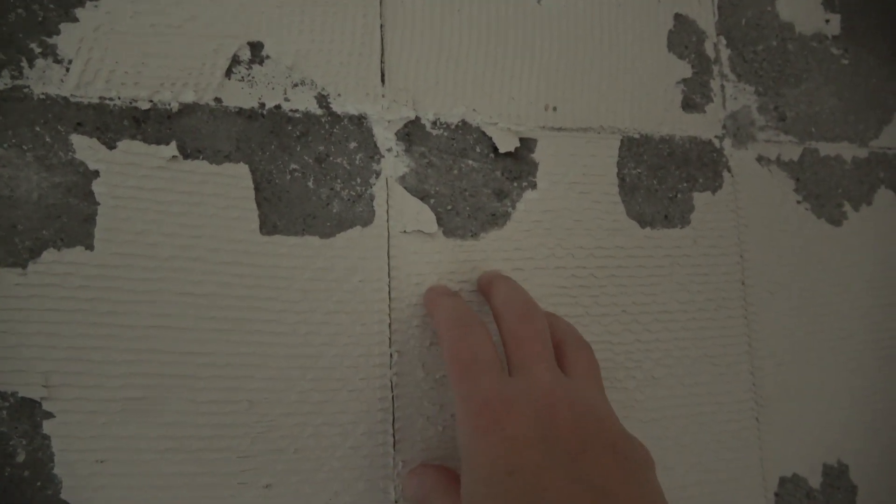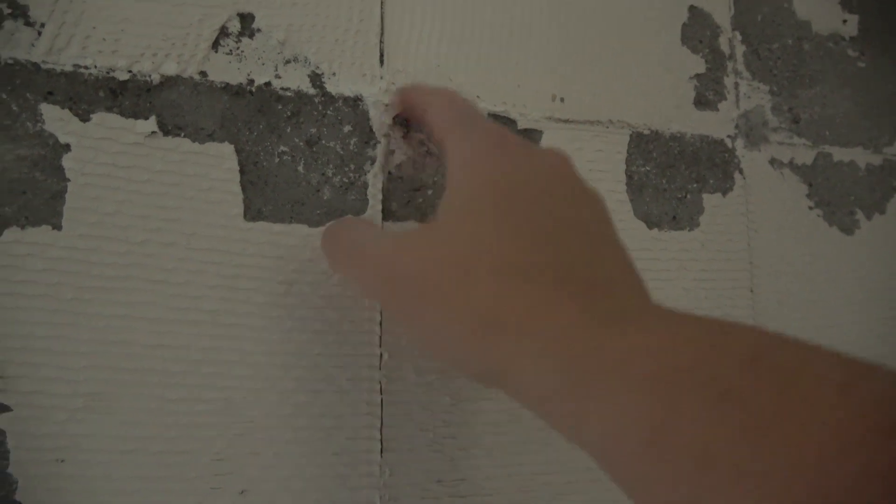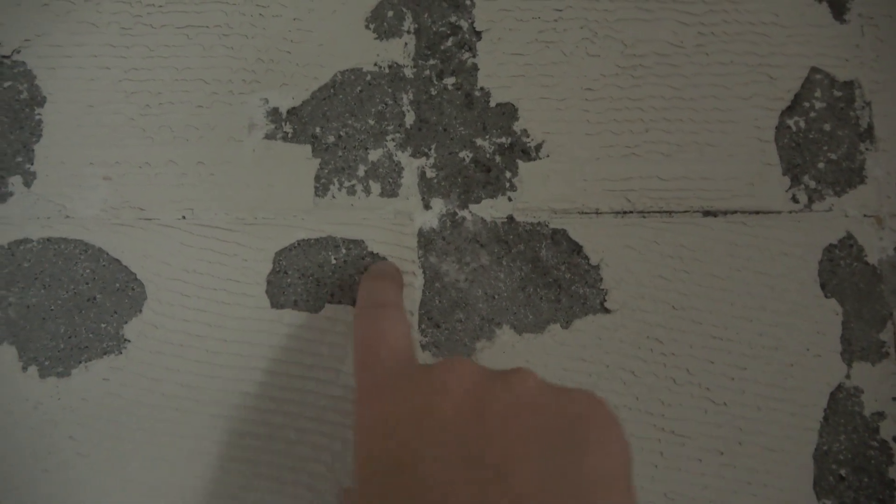It's another weekend. I didn't have much time during the week to do something, and that was probably a good thing because what I've figured out now is that the tiling glue is kind of drying and it's coming off. So as it's Friday again, I'll go and hammer out here. There are still tile spacers in there — I'll chisel them off and bit by bit, maybe take a little steel brush and flake them off. Here in the corner there are a few things I still need to chisel out. Just tidying up to have this ready for plastering and for tiling.